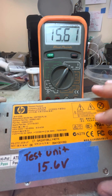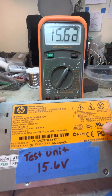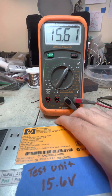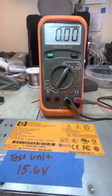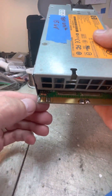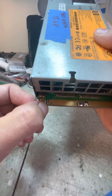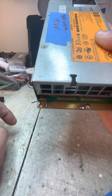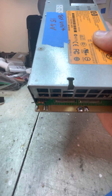48 amps is a pretty hefty power supply, so I'll show you how to get the voltage up and deal with the overvolt protection. The first thing you need to do on this model — some use a jumper, some need a resistor — this one takes a resistor. Pin 33, the first pin, and pin 36 are your two turn-on pins. You need a 470 ohm resistor across those for this particular model. If you just use a jumper they don't like it and they flip out.